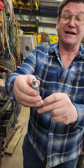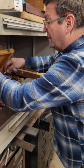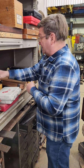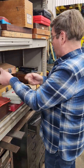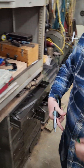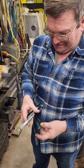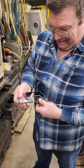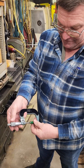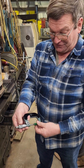However you roll it, all you have to do is get used to not cocking it, because if you're cocked a little bit you can get friction before it's ready. Feeling for dead square — you get used to that by doing a round piece. Then go to a flat piece. The hardest of all to get used to, as far as picking up a zero on a micrometer, is where you have the standards that you set the micrometer by.